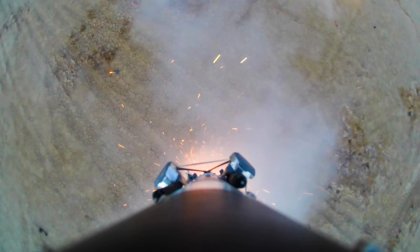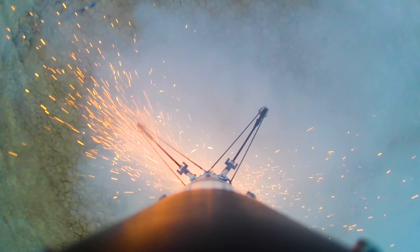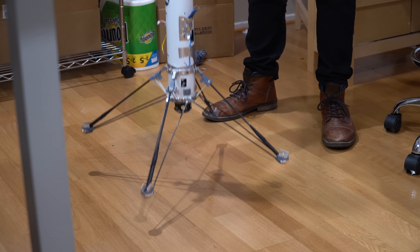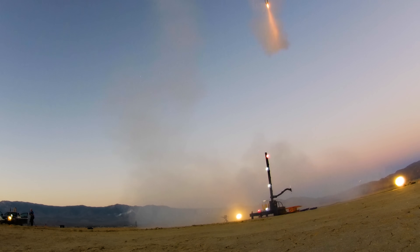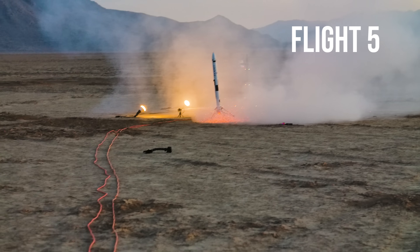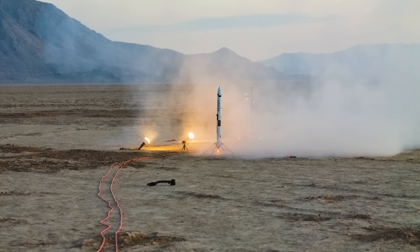What's not so great here is these legs. When I designed the rocket and allocated the mass budget, I didn't include enough for the legs because I thought we'd just use the bounce reduction from the landing pad. But even with the small dampers at the end of the leg, there's still too much bounce — or it's not really bounce, it's the touchdown attitude. When the rocket touches down on the ground, it's not touching down with all four legs at once. If you touch down at an angle, you create a really large moment on the rocket by hitting that one leg, and it's difficult for those other legs to recover unless you have a very wide base.